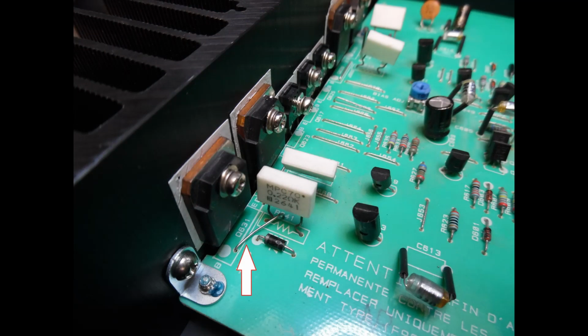Now, on this amp, and this isn't unique to this unit, often what you find are these metal links which are interconnecting to connect different component leads relevant to the circuit design or to the actual layout of the main board. What you can see is once that was heated up, unfortunately the link has sort of dropped out. So that, of course, is an issue.